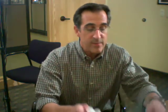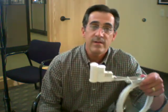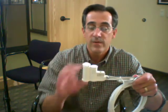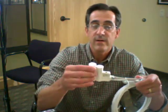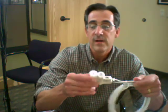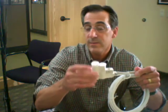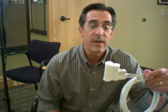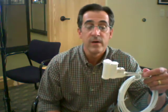The Solar Sync was designed as a simple, very compact sensor. If you look at the sensor design itself, it has a rain click attached to it, which will shut down your system when it rains. This portion of the sensor is kind of the heart of the Solar Sync — it has a solar cell or solar dome on top, and internally there's a temperature sensor. What we're doing with the Solar Sync sensor is calculating evapotranspiration, or ET, based on those two factors alone. We send this ET value to the module, which adjusts the program inside the controller.